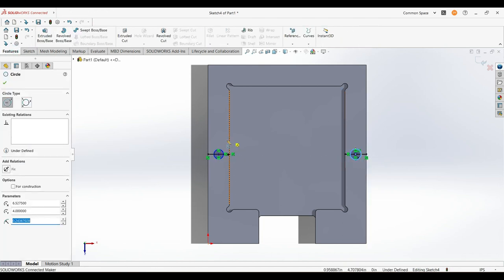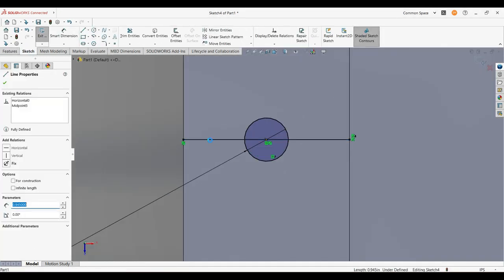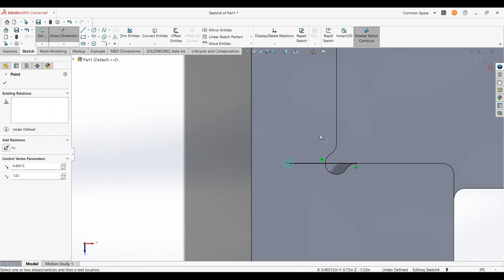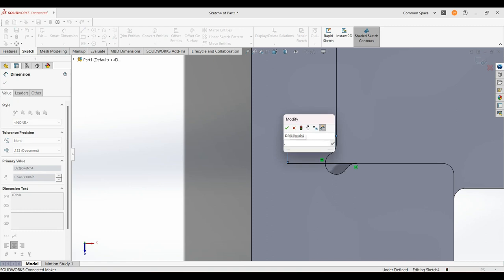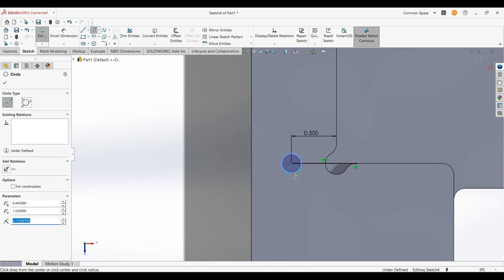One of the more critical features is this little hole on each side, which is going to be for a dowel pin to go through. That's actually going to go all the way through this three-quarter-inch piece into the spoil board — that's how you actually place this onto the machine. Last but not least, I need a little locating hole on the side for my diamond drag bit to locate to. I want that to be a half an inch from the left side of the acrylic and horizontal to the bottom of the acrylic.